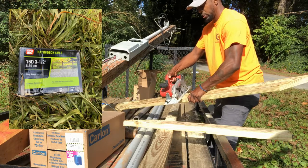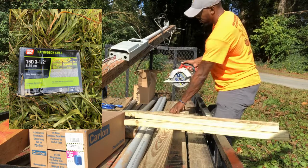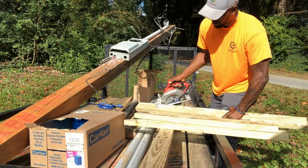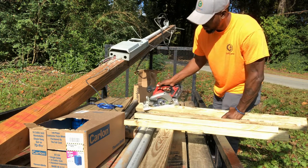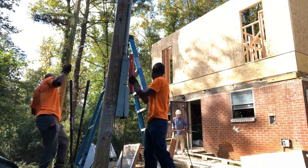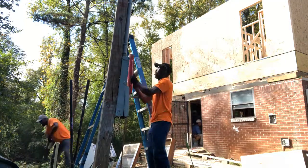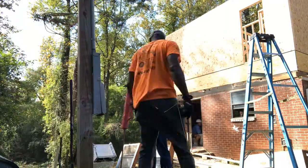From there, you want to cut some stakes. I cut my stakes pretty long so that when beating them in, if I break a piece, chip a piece off, or mushroom the head, I can cut the mushroom part off and keep beating it into the ground deeper. I use 16D galvanized nails, at least three and a half inches, so I can penetrate through my supports and into the main six-by-six pole where all my service components will be mounted.